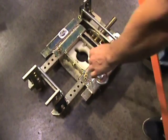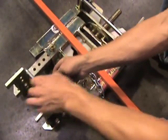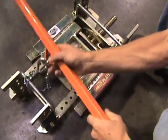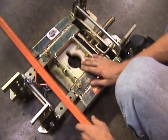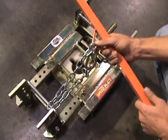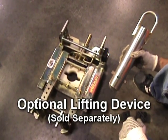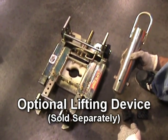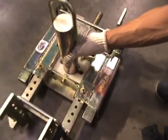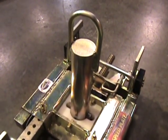The final piece of the speed plate is your safety bar. Clip it on the opposite end from the threaded wheel, which is the heavy end — it just keeps the unit from dropping down in the hole. Once your speed plate is locked into position in the frame, remove the safety bar before the cutting operation. It's used in cases where you want to cut the hole one day and return the next with just your speed plate and lifting device to lift the casting from the road without the six-shooter.